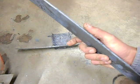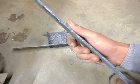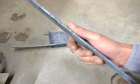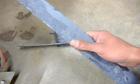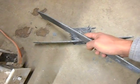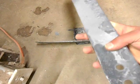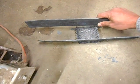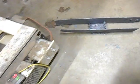Now these baffles right now, with the scale on them, look like they're a little bit over 1/8 of an inch thick. These started off as 3/8 inch thick leaf spring sections, and they scale up bad. I mean, you can see that scale just popping off of there, and it'll come up in big sheets, especially at the higher temperature for heat treating stainless.